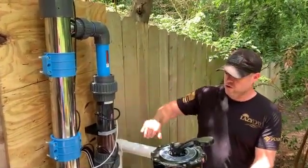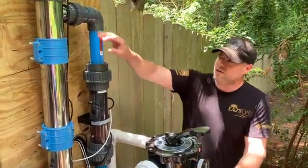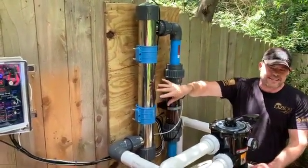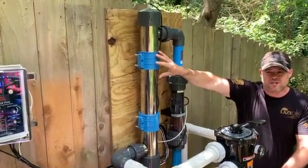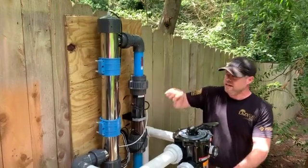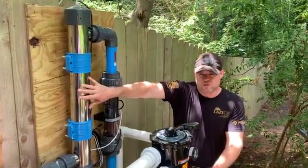Within this chamber you have both the titanium grid that generates the hydroxyl radicals and the copper bars which generate the copper ions. Right next to it we have the high exposure time ultraviolet light chamber. This is where the water passes through and is exposed to ultraviolet light, which basically damages all of the bio threats in the water at the DNA level, preventing them from being able to reproduce — which is an important component. So we've got titanium hydroxyl radical production, copper ionization, and high exposure time ultraviolet light.